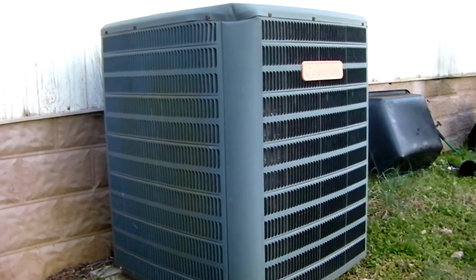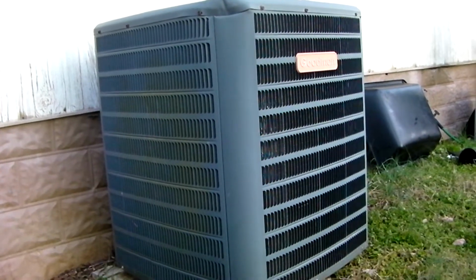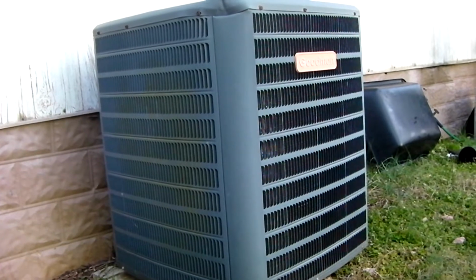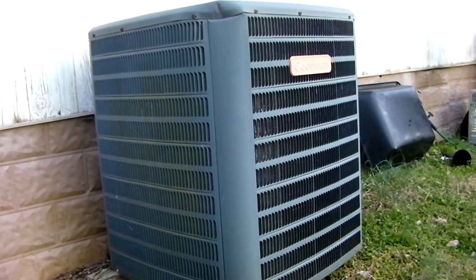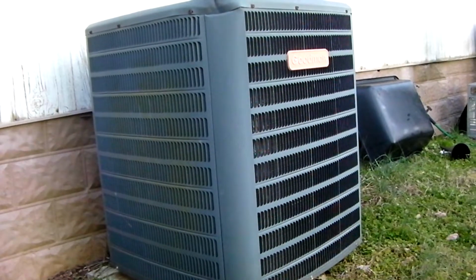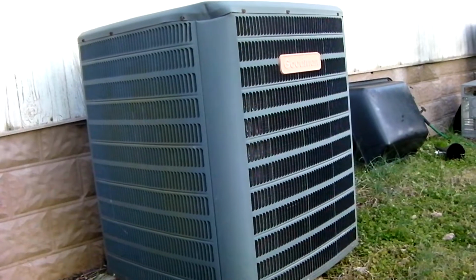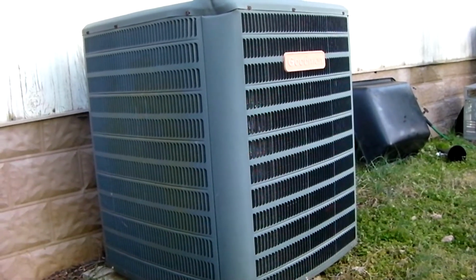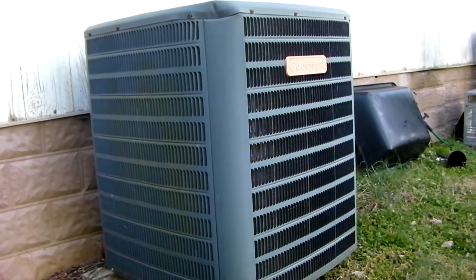This is such a dumb idea. It's such a dumb waste of energy. Because I'll be honest with you, with time temperature defrost controls, more often than not, there's no reason for the thing to be defrosting, but it's out there defrosting, running your electric bill up sky high. Because when these things defrost, they switch back into an air conditioner, and you can either put up with cold 50-degree air coming out of your vents on a 30-degree night, or your backup heat will come on to warm the air back up.